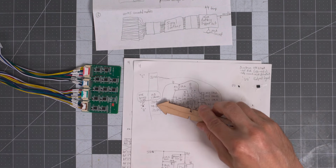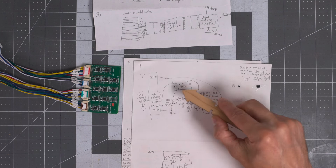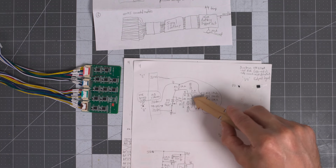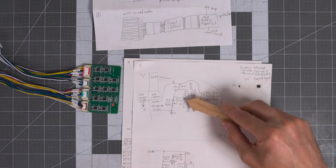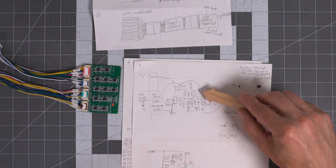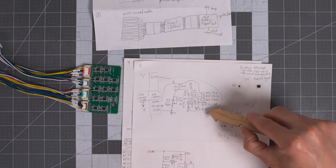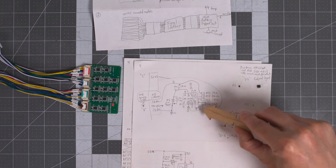We have a pretty typical B6 here, so we're powering this. We have a 1K resistor here, probably just to limit the inrush from these capacitors, and this doesn't pull that much current. I actually calculated that. We'll look at that later. And then this is already looking like an inverting type topology here, just looking at the way these signals go. This was a little interesting.